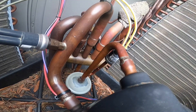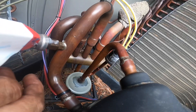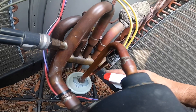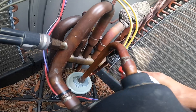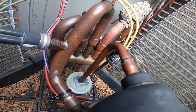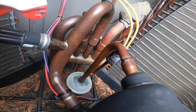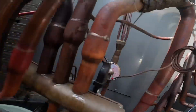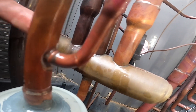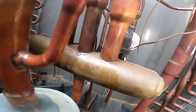So I put a little bit of pressure on it, and you can see around here it looks like there's some oil. Here's a usual spot. I found my leak — you see that little crack right there? That's on my high pressure switch.